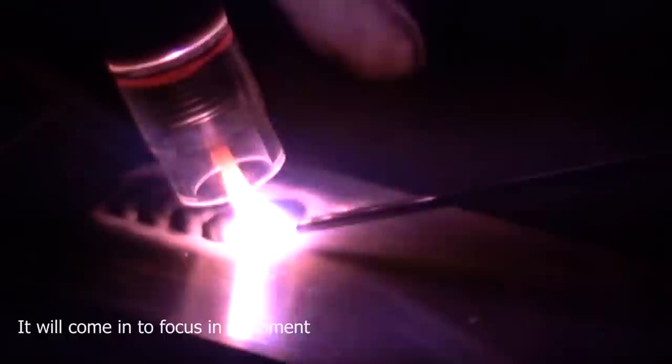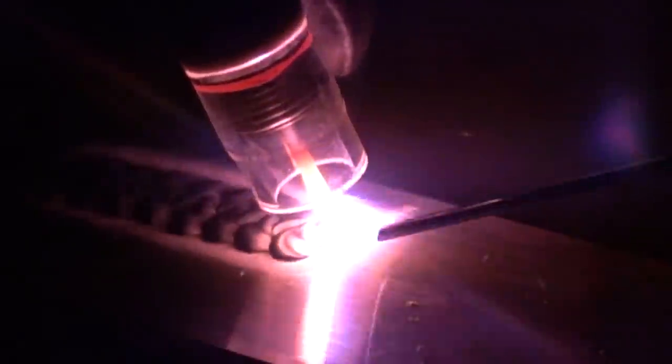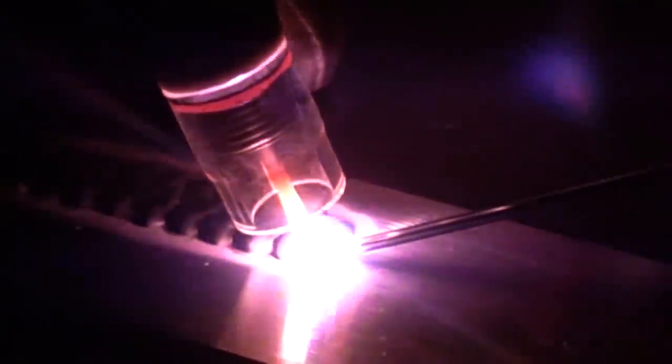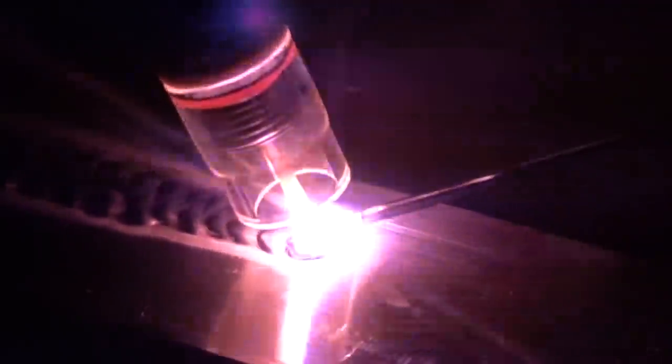In this one I also wanted to switch it up and throw down a big fat weave to really show you how well that puddle freezes. It takes a minute to get heated up, but once it does it runs a lot hotter than most other welds because you're concentrating so much heat into one central area. Doing a three-dab-wide weave like this generates tons of heat, and you can see how ridiculously controlled this puddle is even at 160 amps. Every time you move that torch away from the puddle it almost instantly freezes. You quite literally program this thing to say: just enough to get under the surface, just enough to clean without a fat etching line, and give me all that freezing action you'd normally get out of a high-frequency triangle wave type puddle. This is absolutely incredible and by far my favorite function on this machine.